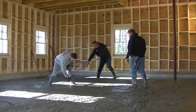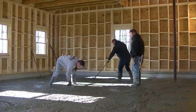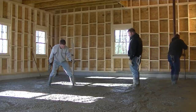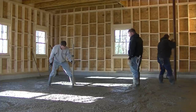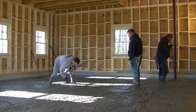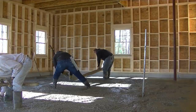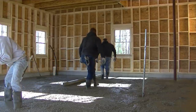I'm taking my time getting my edges mag. Now I'm shooting my wet pad in the middle. I got the laser set up to whatever slope that is — probably about three quarters of an inch lower than the back. We're going to use that wet pad to screed off from. I use a Topcon RL-H5B laser — there's a link for that in the description if you want to check it out. That X means it's right where we want it. I'm going to put another wet pad right there, a little bit lower as the floor slopes out the doors.